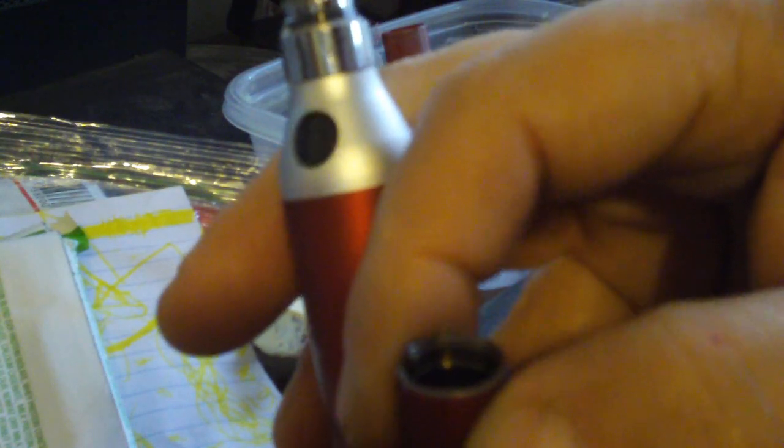But I would imagine you don't want to have your O-ring crimped like that, although it may not be critical in this particular application. You don't want to have any dirt on the threads. You don't want any cat hairs all over it. I can see that I'm wiping quite a bit of crud off the threads. You know, just want to keep it nice and clean. I guess that's good enough for right now. I'll probably take it down and do more to it.